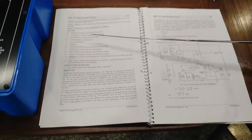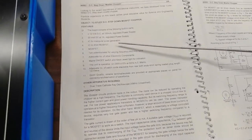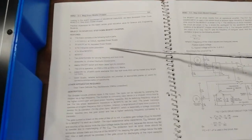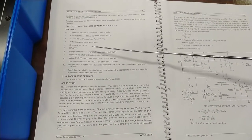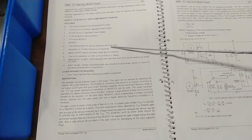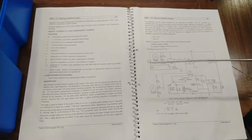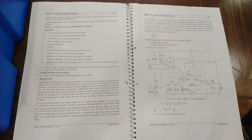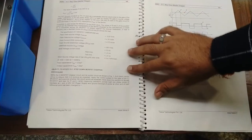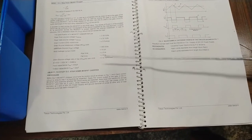In the user manual, different features of the DC step-down MOSFET chopper are described. We are using a 12V ±DC 100mA regulated power supply and a 20V DC 1A regulated power supply for the load. IC for triangular pulse generation and IC to drive the MOSFET, a MOSFET, and two potentiometers for varying the frequency and duty cycle are included, along with adequate numbers of electronic components.